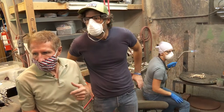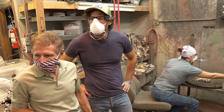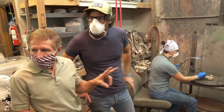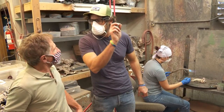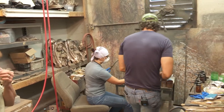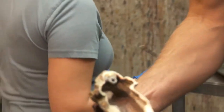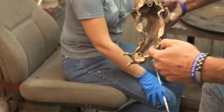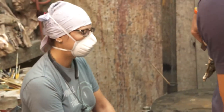Another really good question from Carl Morris: was the small version of the cat cast as one piece or the result of welded components? Probably the tail was cast separately, so it's just in two pieces. It was two pieces with a little hole cut in it that we had to fill in. This is one of the simplest castings — it's totally hollow underneath, and that means they can put all the sprues underneath it, which allows the bronze to flow in. There's also nowhere for the shell to get caught, so this is a very simple casting comparatively. Where just the size of the big one means you have to cut it into all those panels — so many pieces.